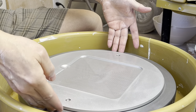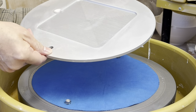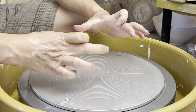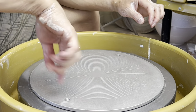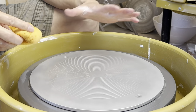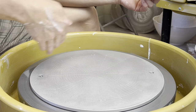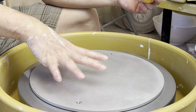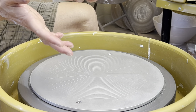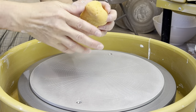Pick it up from the pins — lift it, easy. When you're ready to trim, just flip it over and use the other side. Find your center using the gauge here. If you don't know how to tap-center, this might be easier for you to find the center. If you want to do a little decoration, there's also the same dial with divisions for three, four, five, six, and eight, so you can divide it easily for the most popular divisions.